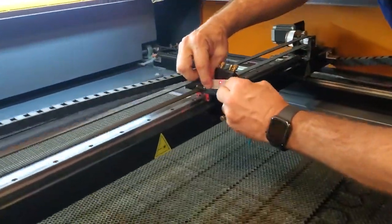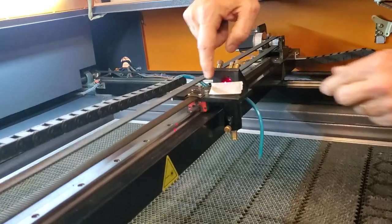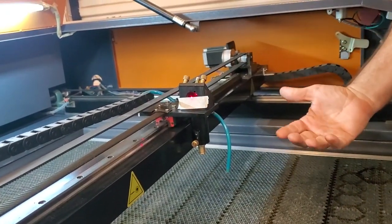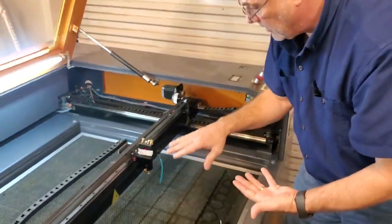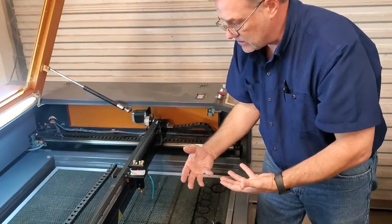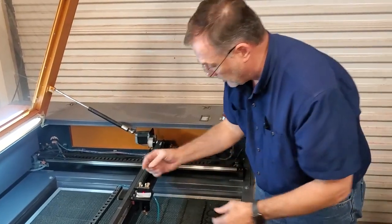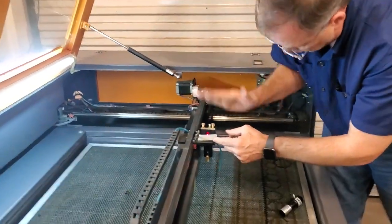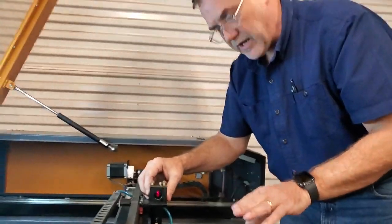The hole was still above center. If I were to take my CO2 laser and run it into the center of the hole, I'd easily be a millimeter off — too high or too low. To get it to the center of the lens I'd have to bring it in at an angle that isn't 90 degrees, and I wouldn't get a good focal point. No matter what kind of lens you put in there, you're not getting a good focal point.